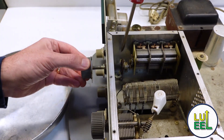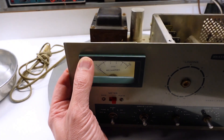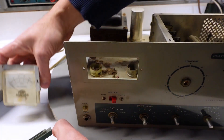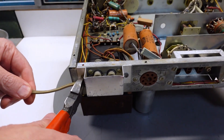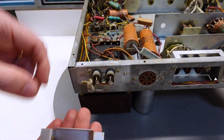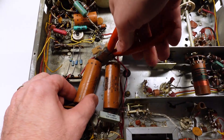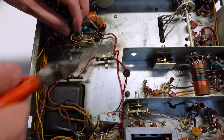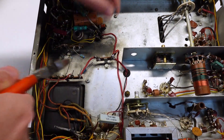In the first episode, I said that I'd be stripping the rig down to a bare chassis. Doing that kind of follows the assembly process in reverse order, especially for the stuff that went on first — it'll definitely not come off first. Some items like the meter and the power cord connection make sense to remove early on, so you can set them aside for protection or to get better access to other stuff. Next comes the wholesale removal of the components that I'm not going to save, like the electrolytic capacitors and power supply diodes. No reason to bother desoldering them — just cut them and toss them aside.